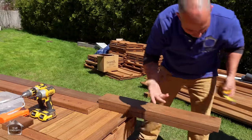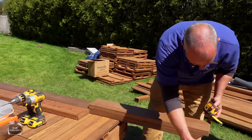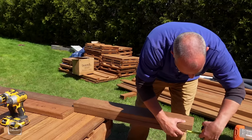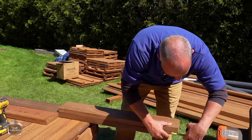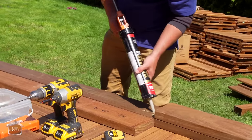And we are actually designing this so this is the face of my beam, and that'll be the outside corner of my post. And so I've created an inside miter to receive the thickness of the second joint. I'm going to slide that over 1.5 inches, and I am going to glue this whole thing together all at once.